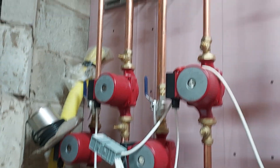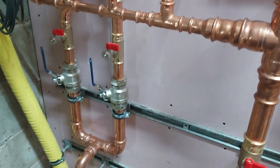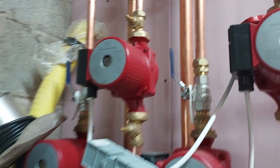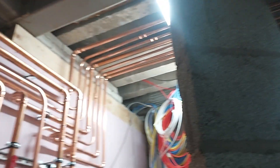There will be some resulting wasted energy from this approach — everything will be insulated — but I don't have a better way of controlling it. If anyone has tips to improve that, I'd be happy to receive comments. The house is split into two sections. The cold water supply comes in at 50mm. Most of these pipe sizes are determined by pressure loss — we don't want excessive pressure drop in the system.